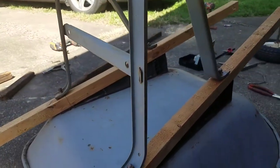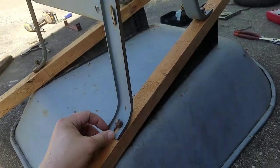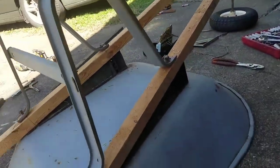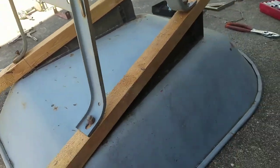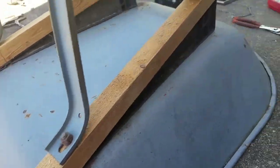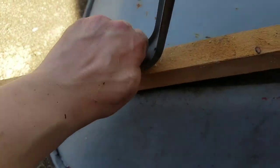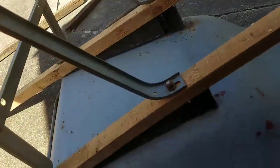It's starting to come together. You're gonna have to put one on, then put this brace in, then twist the other one and put it on. These little short ones like to fall back through, so just put the nut on until you're ready - don't put it on very far, just enough to hold it from falling through until you're ready. Look, we almost have a new one. This metal part will give out eventually as you can see the rust, but we're almost done. We just gotta put that front wheel bracket on, and then don't tighten any of this up - leave it all somewhat loose, just finger tight - that way everything can line up.